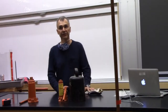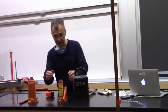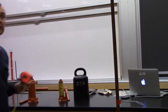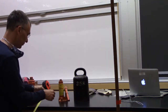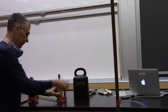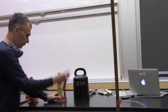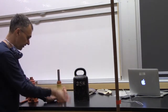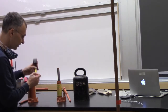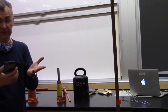With the mechanical advantage of 4, I was able to lift up this 25-kilogram block without too much effort. But if you want a much bigger mechanical advantage, notice that if I crank this thing, it goes from about 30 centimeters to about 5 centimeters — I'm going down about 25 centimeters — and meanwhile this thing seems to go up only a few millimeters. Starting at about 20 centimeters, I'll go 10 times — that's about 250 centimeters — then another 10, that'll be 500 centimeters. So I went about 500 centimeters downward and this thing went up from 20 centimeters to about 28.5 centimeters. That's a mechanical advantage of about 60.